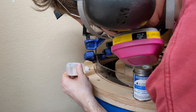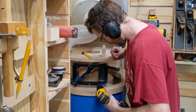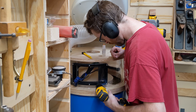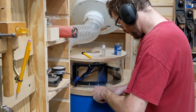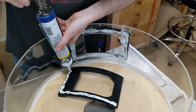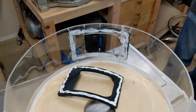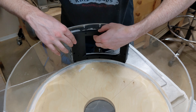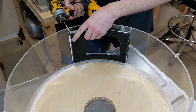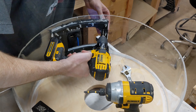I started with an acrylic weld but ended up using multiple adhesives. The intake to the Thien baffle is a three — technically four — part assembly that clasps around the polycarbonate wall. In the final build I also used a boatload of silicone sealant. The polycarbonate wall is adhered to the top plywood but only rests on the wall mount. If it breaks or I come up with an improved design, it should be easily replaceable.